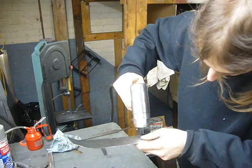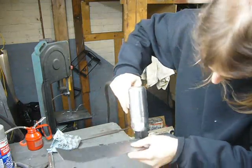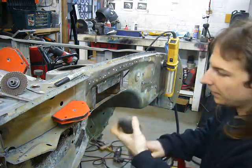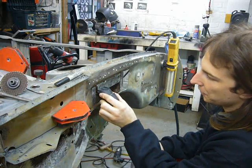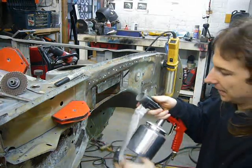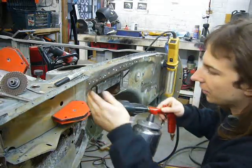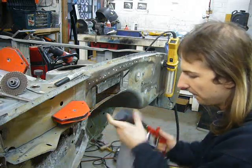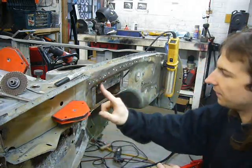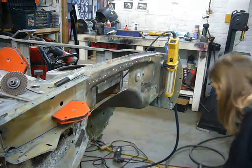If you're doing any sheet metal work at all, you need one of these tools. This is a spot blaster. It has these interchangeable nozzles that are supposed to fit around what you're blasting, and then the used blast media is supposed to go in this bag. It mostly works. It still creates a bit of a mess through overspray, but most of the media does go in the bag. I'm just going to use it to give these pieces a bit of a blasting before I paint them with weld-through primer.